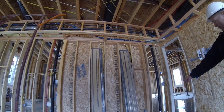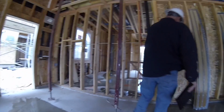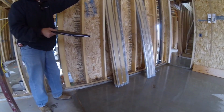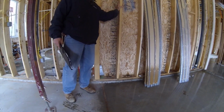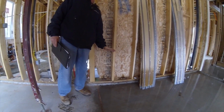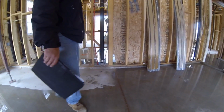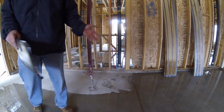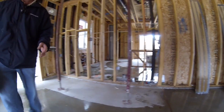And like I said, these hold downs right here, all these, like that wall right there, are about this deep in the concrete. Those are the main things that tie your framing down to the slab. So it's a pretty amazing thing on all this. Then I'm going to do one more thing with engineering, and then we're going to get into some more fun stuff of the house.